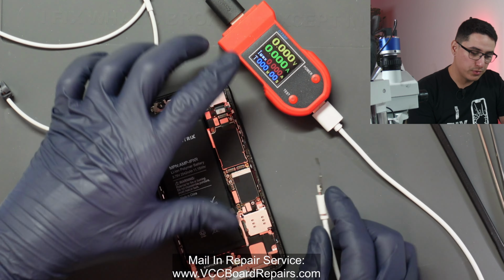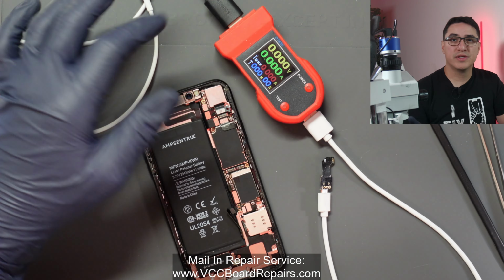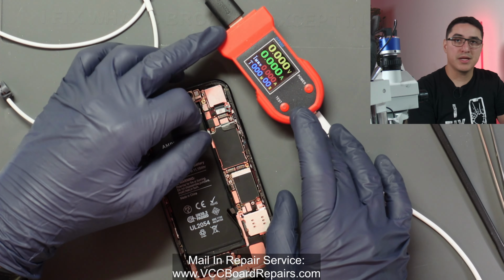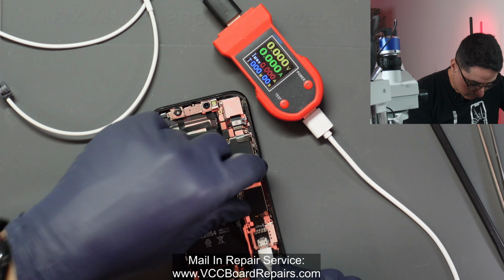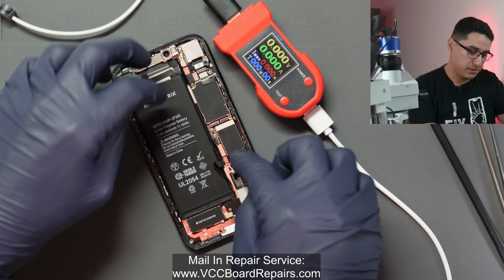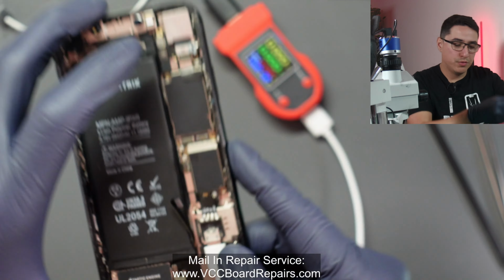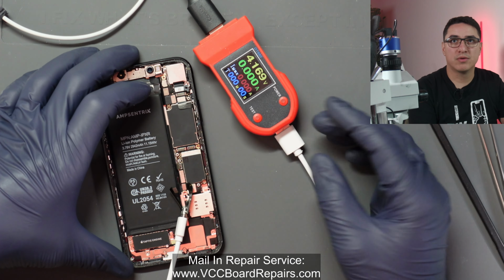So what I'm gonna do is, this is a DT880, it's no longer in production, but I do have other videos on my channel where I show different DC power supply boot cables. This one is very convenient, and I'm actually using the iPhone X plug that I cut, just the battery connector, and then if you plug it in this way, you will get basically a connector for the XR. So I'm gonna push power.